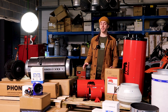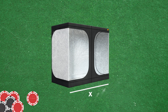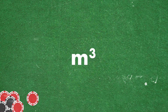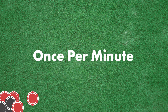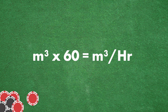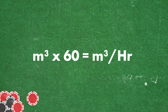If you want to know what size fan you need, you need to figure out the volume of air within your grow room. To calculate the volume, multiply the length, width, and height of your room in meters together — this gives you the volume of air in meters cubed. Ideally, you want to be replacing the air in your room once every minute, so 60 times per hour. To calculate the airflow needed, multiply your volume in meters cubed by 60, which gives you your target meters cubed per hour.